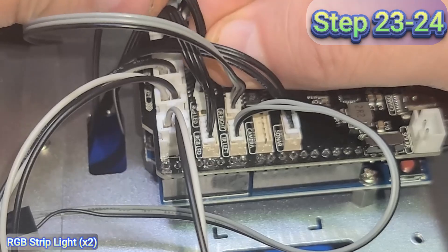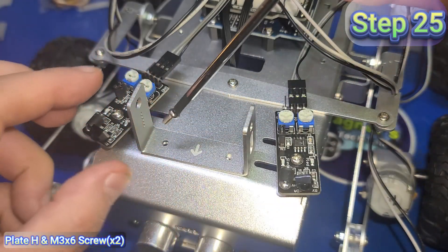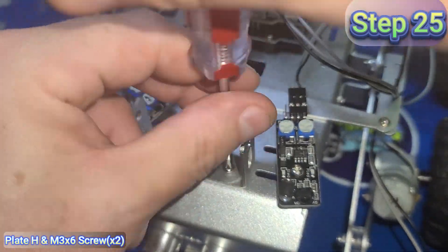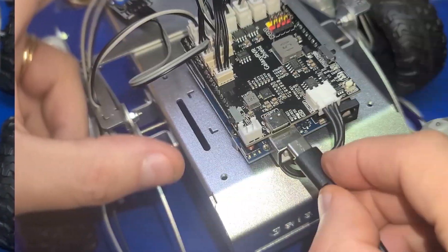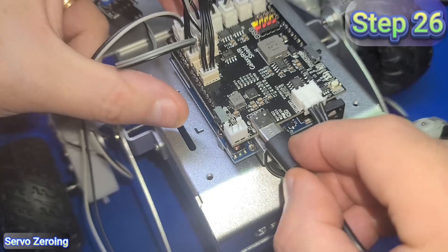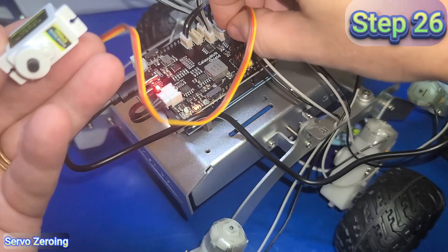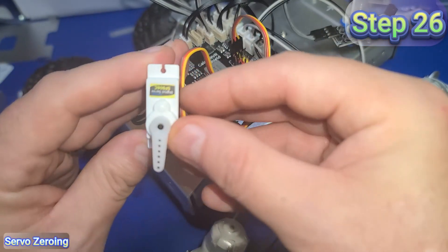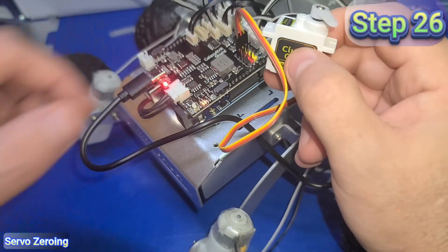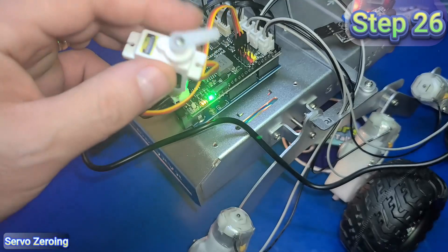The RGB ports don't differentiate between left or right. Now take plate H with the arrow facing out and insert two M3x6 screws to secure the mount to the rover — this will support the servo. In step 26 we'll zero in the servo: plug in the USB-C cable into the port on the shield and attach the servo to the port at the back. When I first plugged it in I thought it was already receiving power and attached the servo arm and screw, but that was incorrect. I needed to flip the power switch on the side; then the servo received power and the arm moved to its zero position.